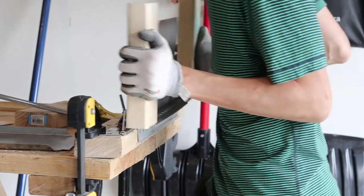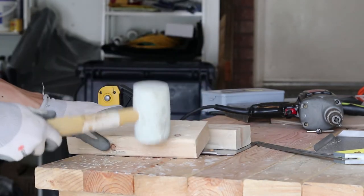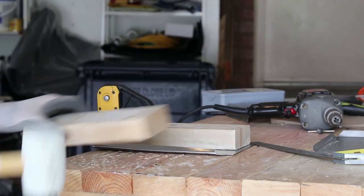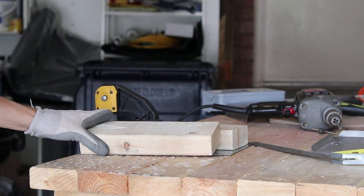For the specific bend I wanted to accomplish, I wanted it flat up against the material. The way I did that was by bending these pieces a little past 90 degrees, then clamping it down and using a 2x4 as a buffer, and using a ball-peen hammer to start forming away at the edges. I found a pretty decent result with this, but there was also a little bit of warping with the material, and I'm not exactly sure how to fix that yet, so that'll be for a different video.